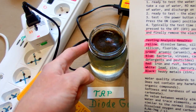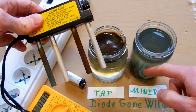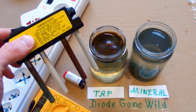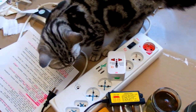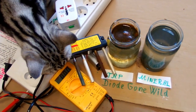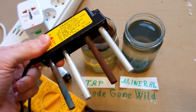I can also see some brown here but there is no brown in the chart. So it's horrific to see what you are actually drinking. But I think that in reality this dirt doesn't come from the water — it comes from the electrodes. They are trying to convince you that this device can reveal what's in the water, but actually this dirt comes from the electrodes dissolving by the electrolysis. So the electrodes dissolve and create some metal compound in the water, meaning any kind of water will look completely toxic with this device.